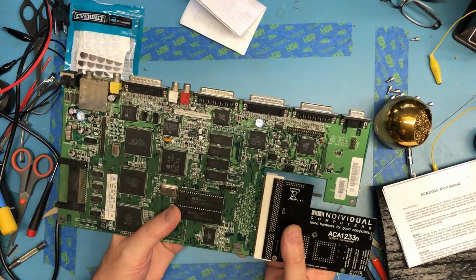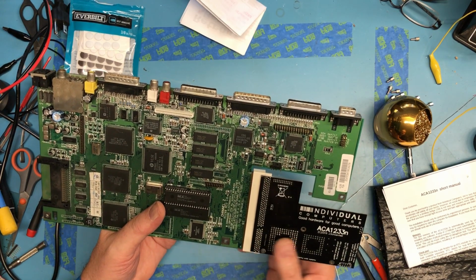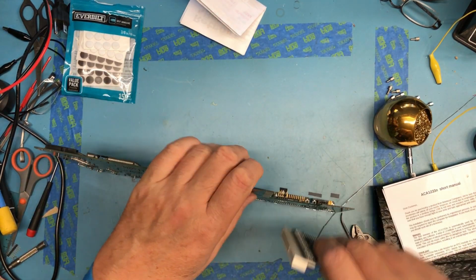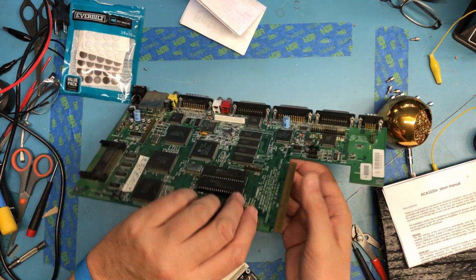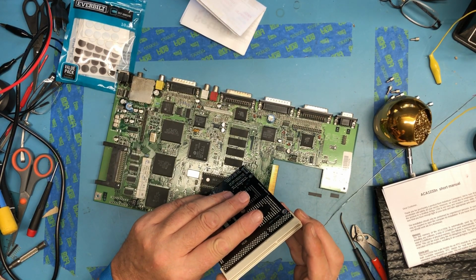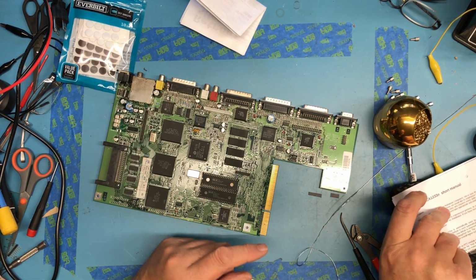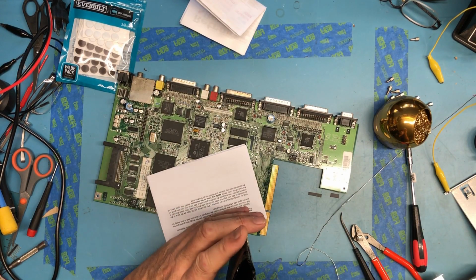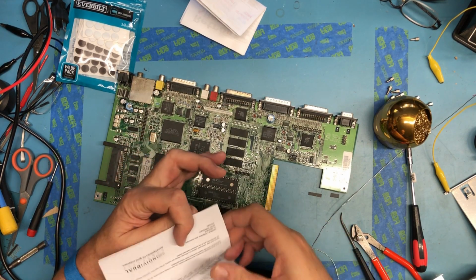I definitely locked it down on there. So happy with that. I'm assuming those are gold plated down inside of the connector. They should be. So it's gold to gold and not a tin connector to gold. Don't want to mix metals and connectors. It will react.